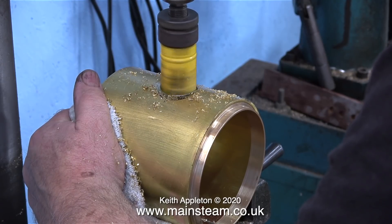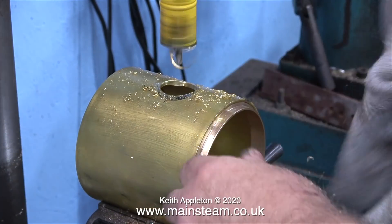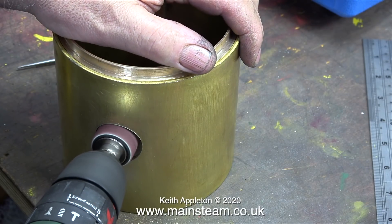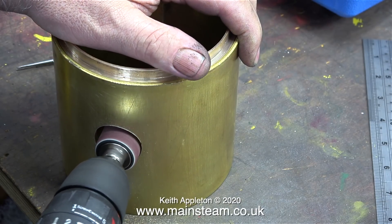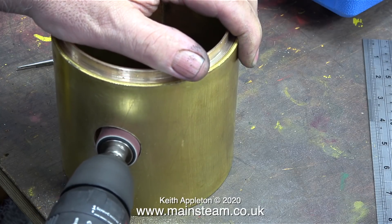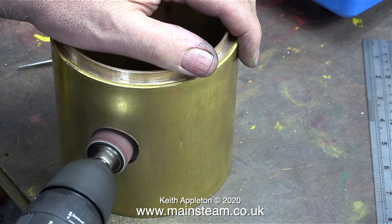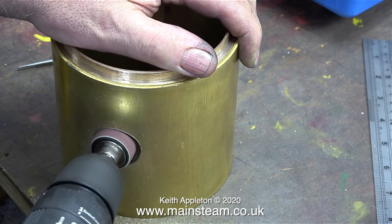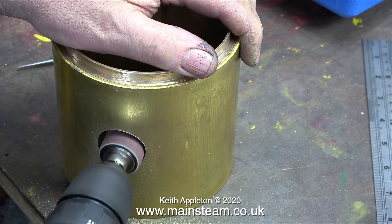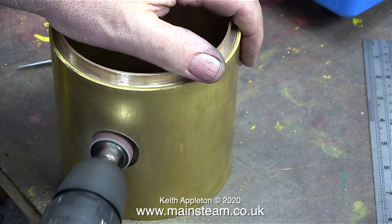If drills and things like this lock up, I'm strong enough to hold the component and stop it from spinning. That's the chimney mounting hole cut — now I need to make it the right size. My first weapon of choice is a drum sander in my small electric drill. It's very important to move it back and forth to prevent damage to the drum sander by sanding in one place, and because I'm constantly presenting a new surface to the metal it cuts a lot better.